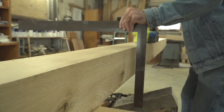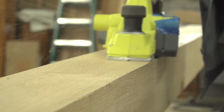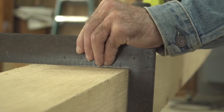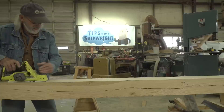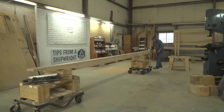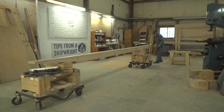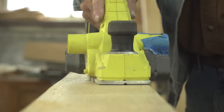It's funny using a framing square — you have to hang it over the timber exactly plumb, because if you don't, it'll lie to you. You have to be careful so that when I put the scarf on the end of it, it won't become twisted. If that timber was twisted, I'm taking it out. If it's a little bent, I'm going to take that out too, but under construction. If it's twisted, I have to take it out now. So I'm prepping that timber up for scarfs on both ends.